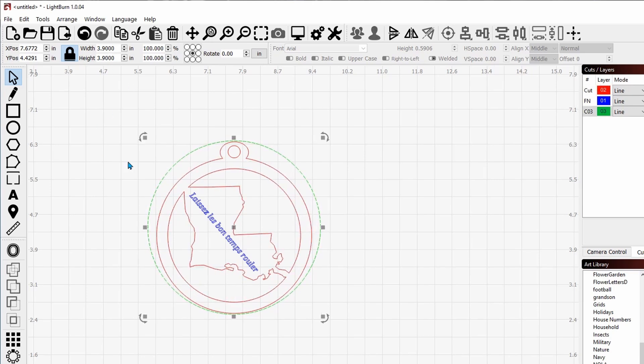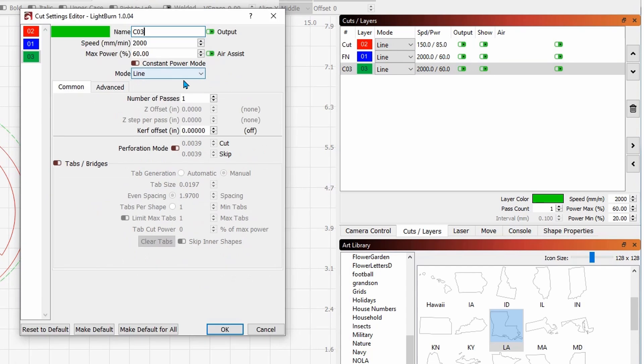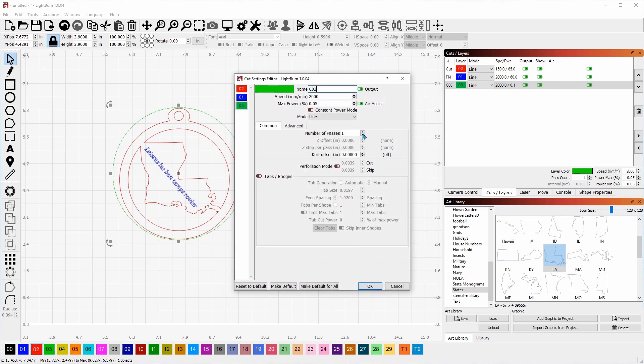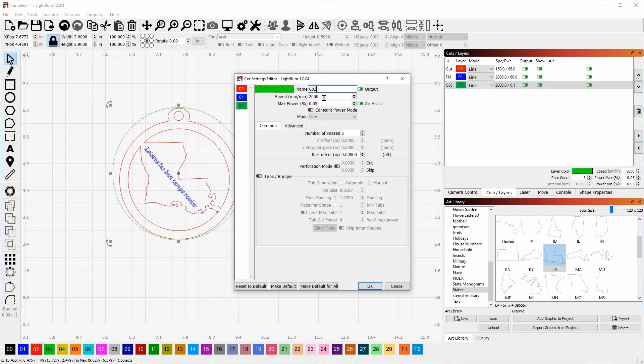Right now we're talking about framing. I have my work piece here — it's going to be cut out of wood. I look at the width and height and find the largest number: 3.854 inches is the largest. I want this to be three and a half inches wide, which is my standard for these hangers. So I created an outer circle at 3.9, just slightly larger than my actual work piece.